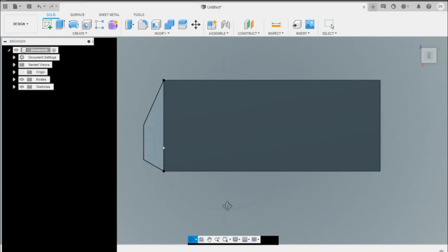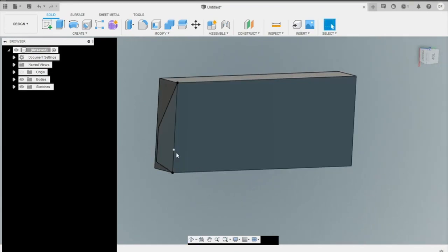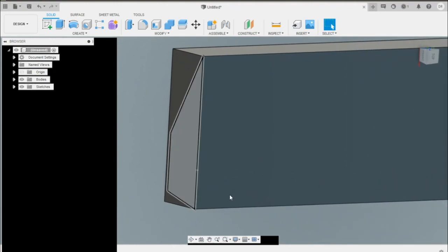So now I'm going to determine the thickness of the plate I'm using, and in my case I'm using 3/16 plate, which is 4.76 millimeters in thickness, and that is pretty thick in comparison to most intercoolers. I would say they're probably around the 1/8 inch range, but I like to overbuild rather than underbuild. So if we could possibly exceed the advertised rating of this core with some type of different fuel or different type of cooling, then this plate will still allow us to exceed that. So that's why I use 3/16.